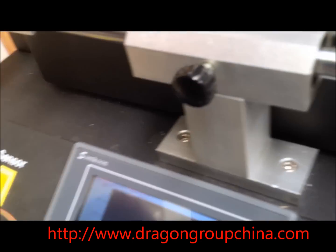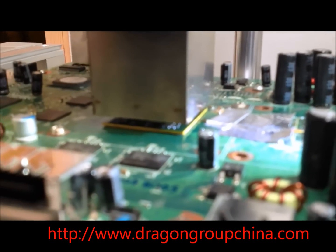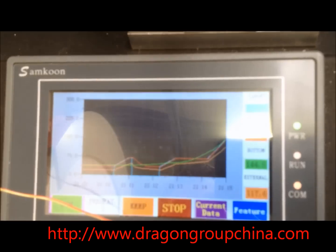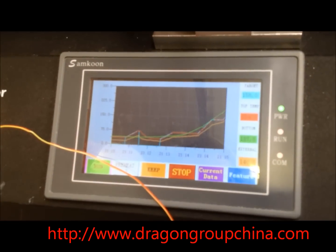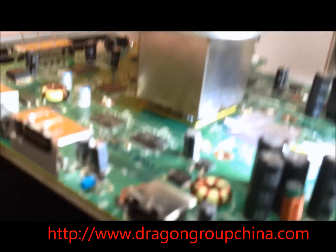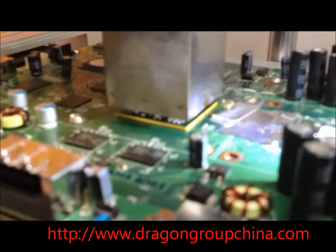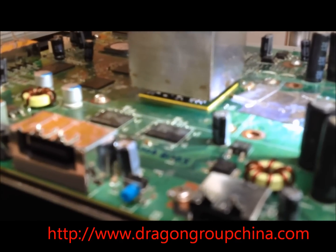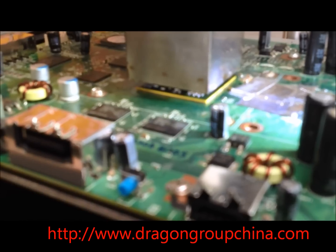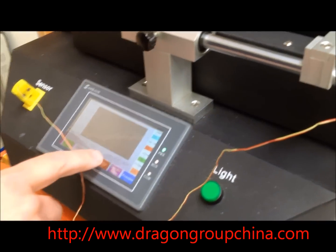On the first part of the profile, we'd actually start off quite slow on the top and let the bottom heaters crank up to get the board going, and then it'll go onto the next stage. Now the chips are starting to drop, the balls are in there nicely. So I'm going to stop the profile early, because this is actually the profile I designed for a lead-free chip, so I'm stopping it on stage four. I don't want to get too far — it's dropped in nicely, so I'll hit stop.